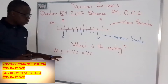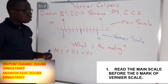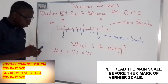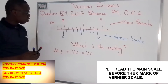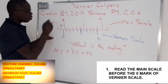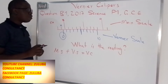How do we get the reading of the main scale? The main scale is usually the one on top — the one denoted in centimeters represents the main scale. We read the main scale by looking at the mark that is before the zero mark of the Vernier scale. This line, which is before the zero mark of the Vernier scale, that is the reading of the main scale.